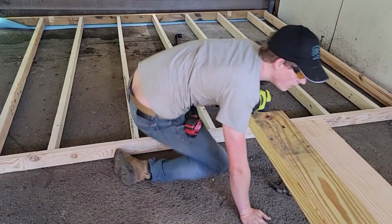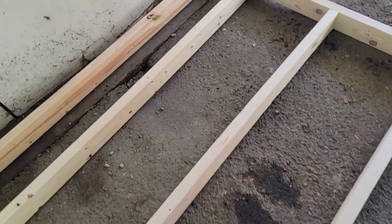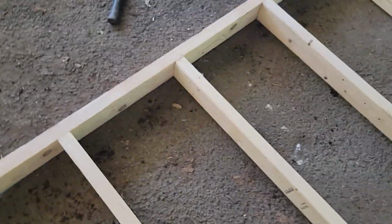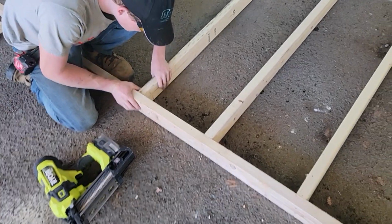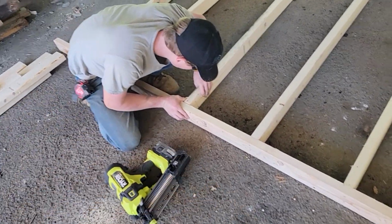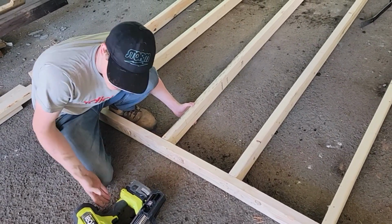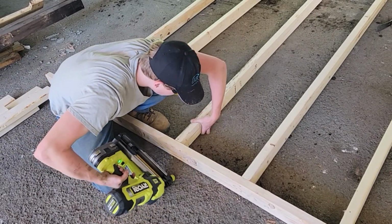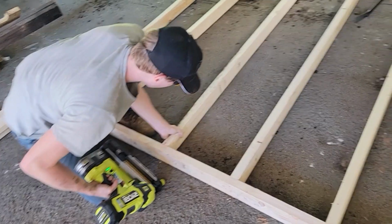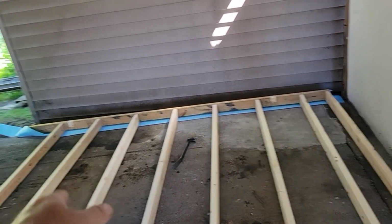Out of nails. We're on unlevel blacktop in here, so it's a little harder to frame than a flat wood floor, but this is going to give us our sheathing to go beyond the end. Line up at 4 foot on center.